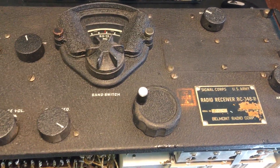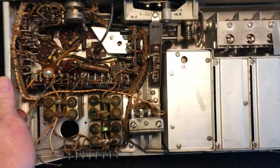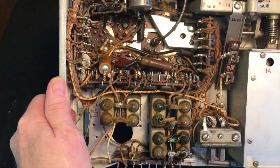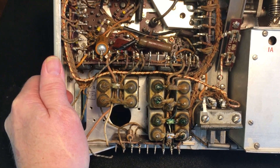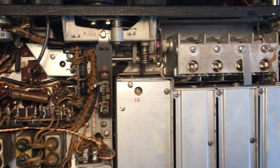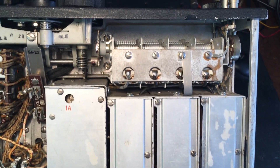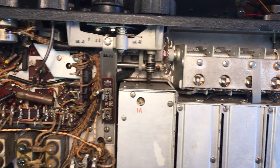So the process we're going to use is to remove everything — all the wire that you see here, remove all those oil-filled capacitors — but we will keep intact these RF tuning units and, of course, the variable capacitors and all the mechanical parts.